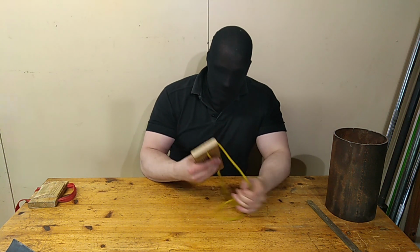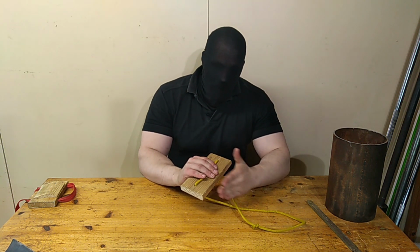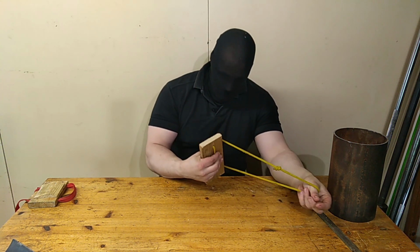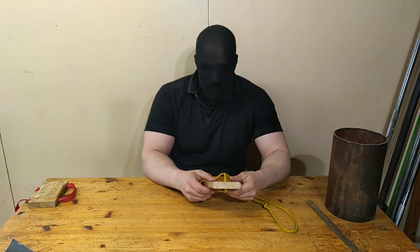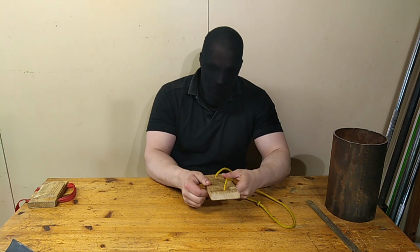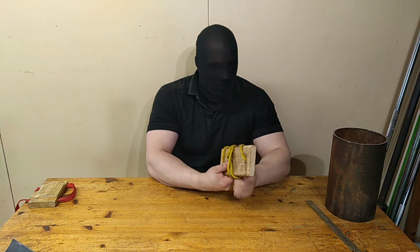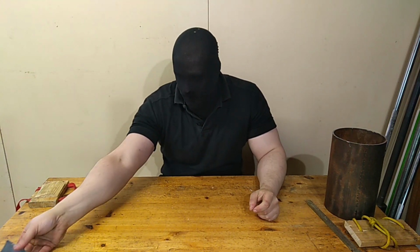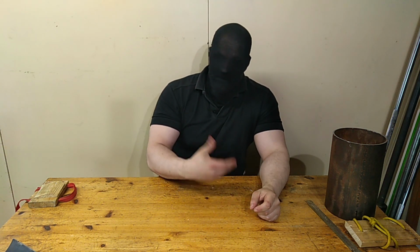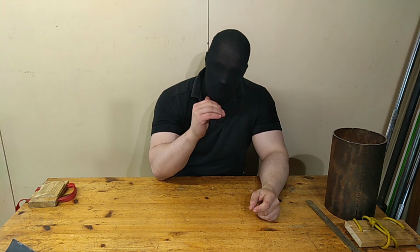So there are actually three forces applied. Three forces in action in a board handle like this, where the force is pulling from above the point where the fingers are applying the force in. The two above here create the torque, which the third one has to cancel out, which is usually the base of the thumb. So these torque creating solutions are not so ideal. If it's just your thumb which has to cancel the torque out, then the thumb becomes the limiting factor in the handle, and not possibly your fingertips.